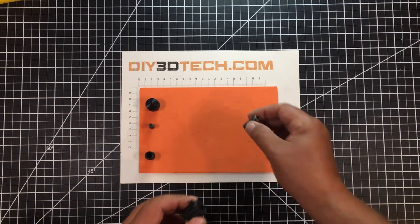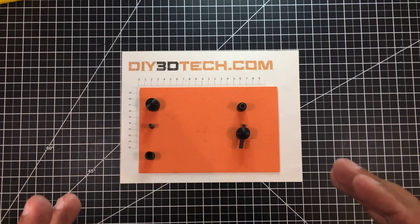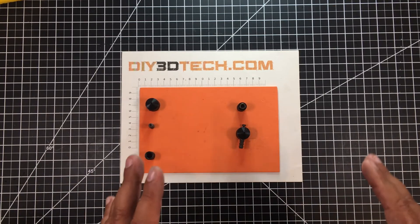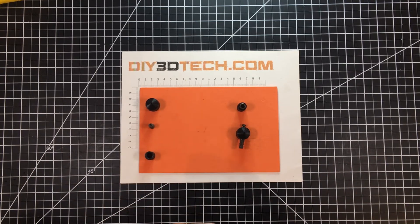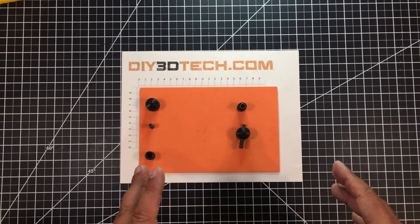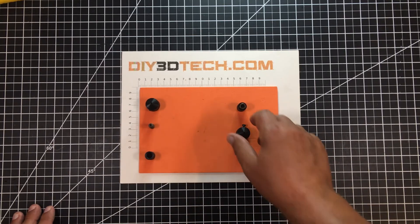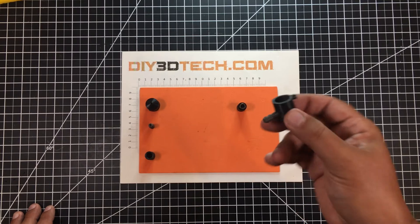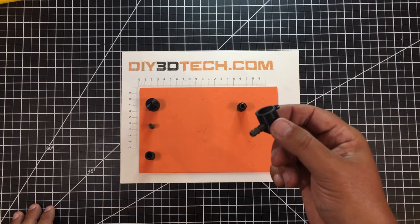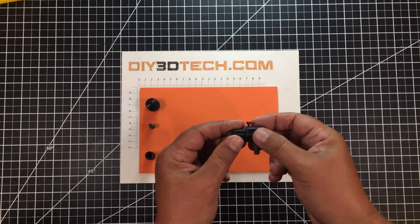Most of the material I'm cutting or engraving with my Ortur laser is pretty much the same height, so I don't have to change the focus too much. Once I set the initial focus I can run out my jobs before having to change it, so it's not a huge problem. You really need to use silicone tubing to connect to this because it is so flexible — vinyl tubing is very restrictive and will pull on this unit, which will pull it out of true.